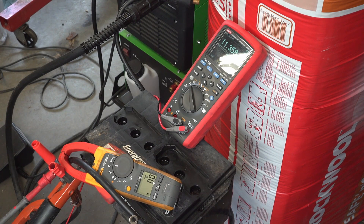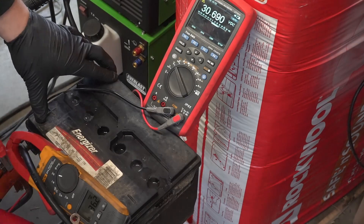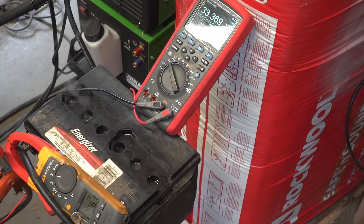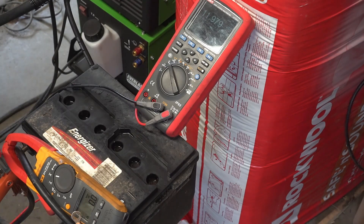It took 26.5 volts to drive the battery at 40 amps. After this cycle the battery settled to 11.4 volts open circuit — not a good sign, as that's lower than earlier numbers. After another 10 minutes the battery settled to 8.62 volts, much lower than what we'd gotten after the first few runs. It became apparent that one or more cells had shorted internally. I attempted percussive maintenance with a dead blow hammer and was temporarily able to coerce the battery to a higher open circuit voltage, but the damaged cells always reverted to their shorted state.